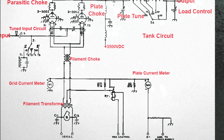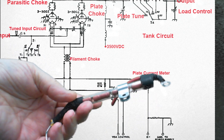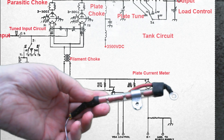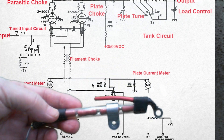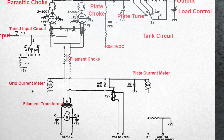In order to measure the high voltage, there's a series of resistors that drop the voltage down to a number that can be read by a meter without it being dangerous. Each one of these is one megohm, in a tube to keep it insulated.